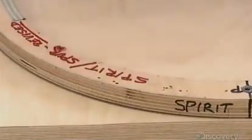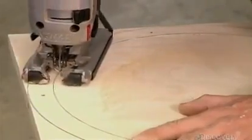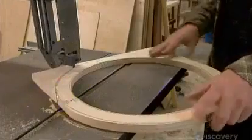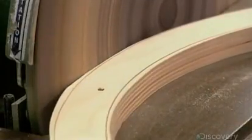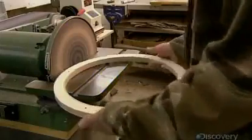They'll encase it within two plywood rings to beef up the width and thickness and to create a substrate on which to glue the wood veneer. Using a jigsaw and a bandsaw, they cut a front ring and a back ring out of European birch plywood, then mill the profile, including a groove inside for the metal ring.